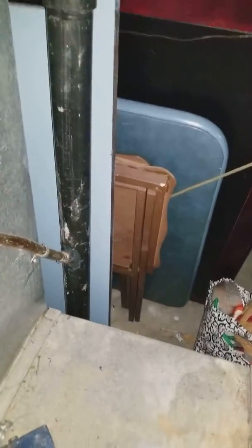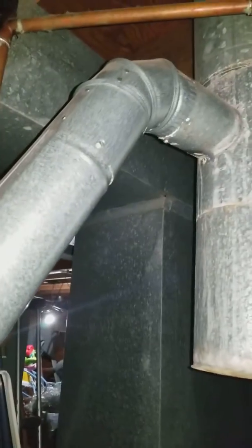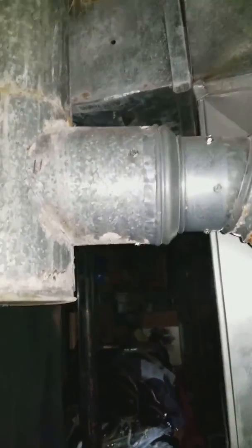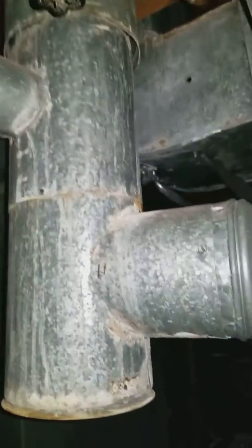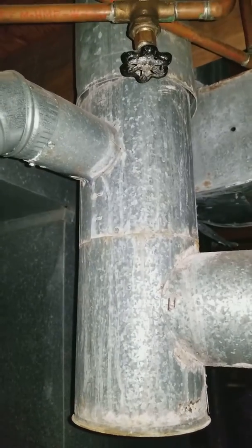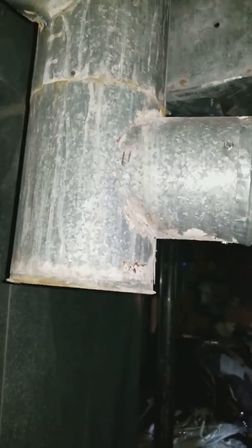The condensate hose comes out here and taps into the main drain waste line. You've got a six-inch flue, three-inch to the water heater, four-inch to the furnace, and it's just corroded — I'm sure it's from over-temperature and the furnace not getting enough airflow. I'm going to replace the tee; we'll need a three-by-six-by-three or three-by-four or five, depending on the BTUs of the furnace.